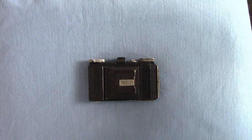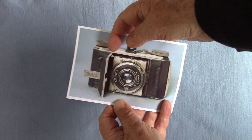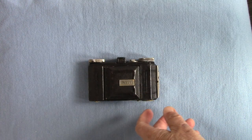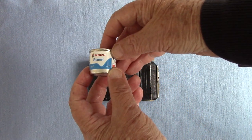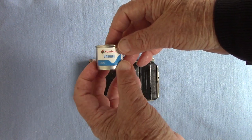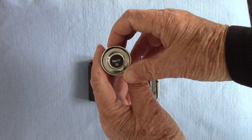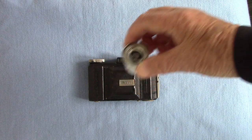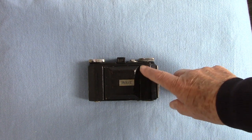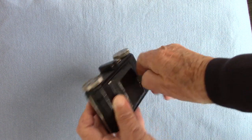The camera was very badly worn - I took pictures of it before, and this is what it looks like after treatment. It was shiny metal because all the black paint had been scraped off. I got some Humbrol enamel paint - I was told to get Humbrol enamel matte black number 33 by a member of the Amateur Photographer magazine forum. I found matte number 33 for two pounds, but it doesn't quite match the Kodak paint - it's too matte and the Kodak paint is slightly more glossy.